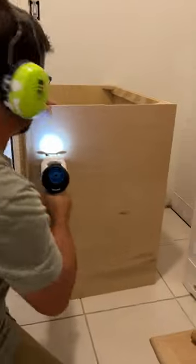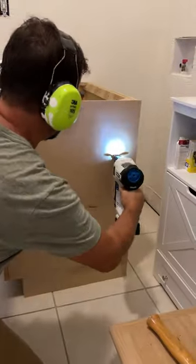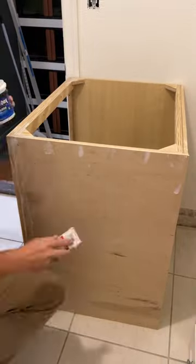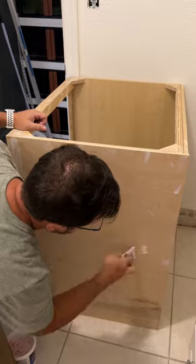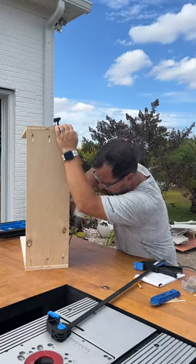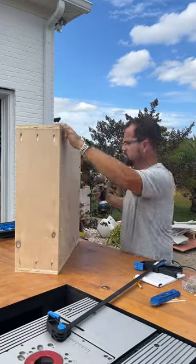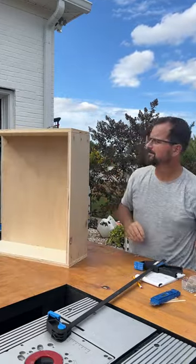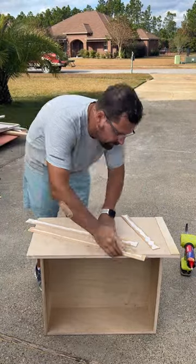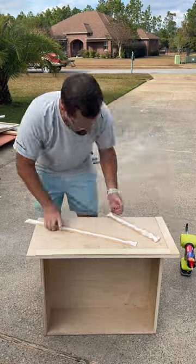I made a skin for the exposed cabinet side from a piece of utility panel — that's roughly eighth-inch plywood. After attaching it with construction adhesive and brads, I filled the holes with spackle and sanded them smooth. I built two identical drawers from three-quarter inch plywood, attached with wood glue and pocket screws. Then I cut strips of utility panel and glued and brad-nailed them onto the drawer face for a shaker-style look.